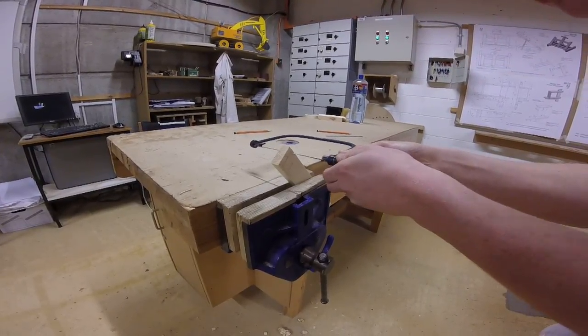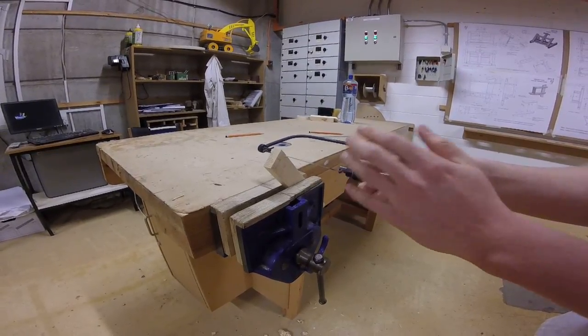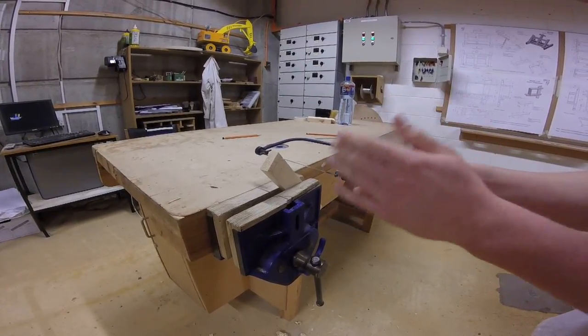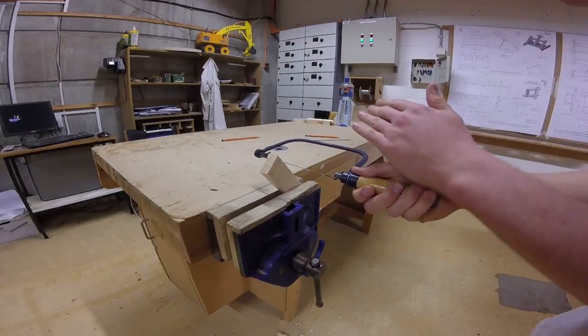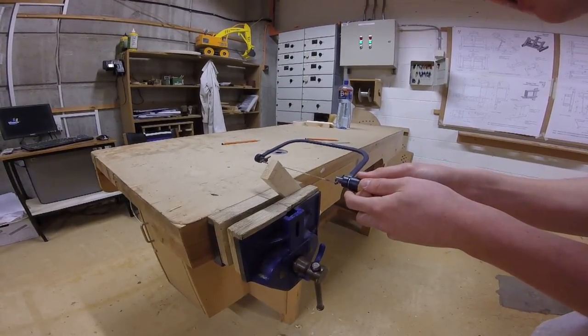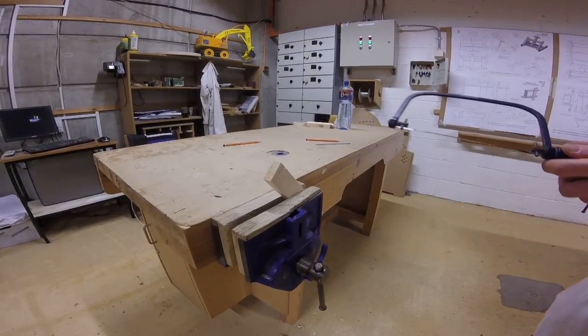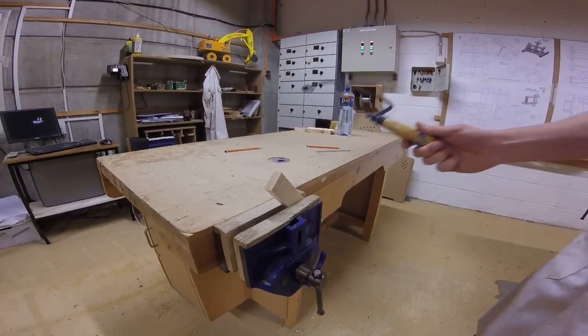It's important not to put too much pressure on the saw or the saw will start to jam and the blade is likely to break. If you do need to take the saw back out — go back the way if you're not going to make your cut the whole way through — instead of simply pulling the saw out, work the saw back and forward and guide the saw back out. This will prevent the blade from breaking.